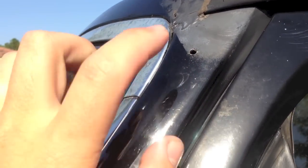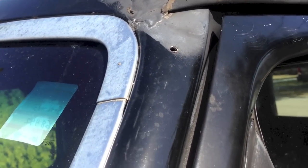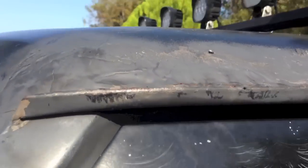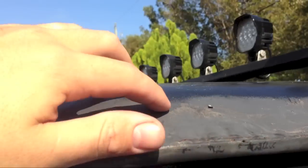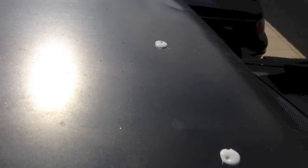When you drill these holes, you're going to need to apply a sealant of some sort, like a silicone. I'm going to use 5200, which is a marine sealant — it's probably one of the best sealants out there and it holds like a beast. I'm going to put a dab around each hole so when it squeezes it gives a nice clean look, and it also seals the hole to keep any water from coming in. You guys can see the holes as they're sealed up — just put little dabs on there. If you have silicone it will hold in place a little bit better, but this 5200 sealant is some bad stuff, so you want to work with it as fast as possible.